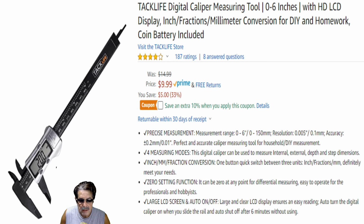Well, to me, it's not plastic. Like I said, it's carbon fiber. I do like the metal ones, like I said, from Harbor Freight, but these are very lightweight. I haven't had a problem with them yet, but if you wanted to make a criticism, you could say it's not made out of metal. Well, for me, as a DIYer, home hobbyist, I measure wood, I measure steel. If you want something that is critically accurate, let's say within 1 or 2 millimeters, you probably wouldn't be looking at this price. I like the price on this. It's an attractive price. It's a good caliper, but it's not for critical measurement. I don't do anything that requires that critical of a measurement. And because you can self-zero this thing, it comes in really handy.